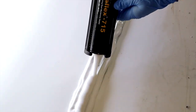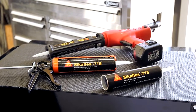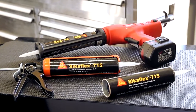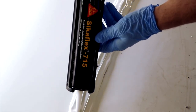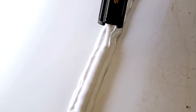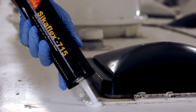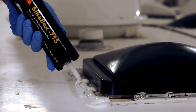A battery-operated gun with adjustable pressure setting is recommended. Other options include a typical manual 18-to-1 caulking gun or a pneumatic dispense gun. Apply the sealant slowly so that the finished bead width has a minimum half-inch-wide overlap onto the roof membrane. Special care must be taken so that no air pockets form between the sealant and the substrates, particularly when two beads join each other. Sikaflex 715 can fully cover trim rails, and screws should be covered with a large dollop of sealant. Unlike solvent-based sealants, Sikaflex 715 will not cause acrylic roof vents to crack if it comes into contact with them.